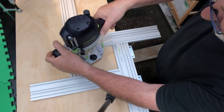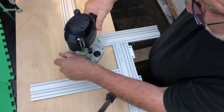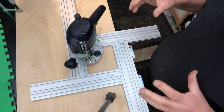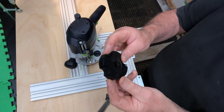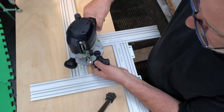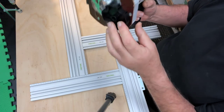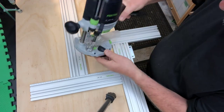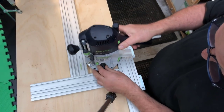Now I just sit my router in here, make sure it's sitting nice and flat, and it's just a matter of running the router around the outside of the track as your guide. Run it down, get your desired depth, slide it along using the track as your guide. There is a little attachment here with codes 24, 27, 30 and 40 - these are the different matching codes. When you slip that on, it spins around and the distance from there to there is the same as the distance from the top of the rail to your board.